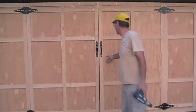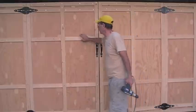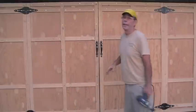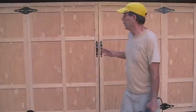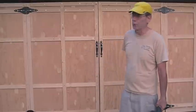All finished. Last thing I did was put on these handles, and before that I put the trim going all the way around. I had to take the doors back off again to put the trim on because the hinges wouldn't work right unless the trim was on first. That was a mistake — so don't do the same thing because it's a lot of extra work.